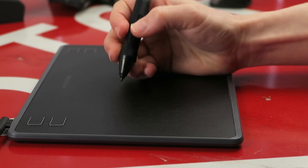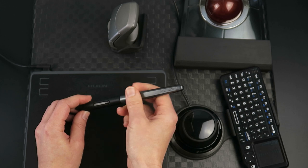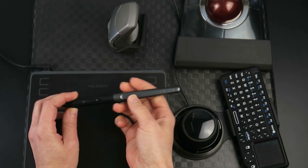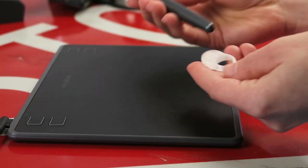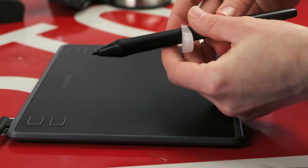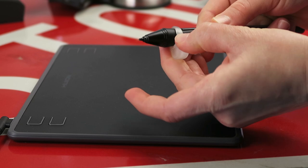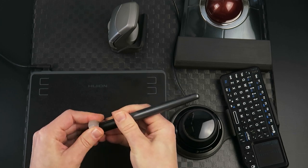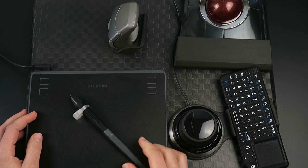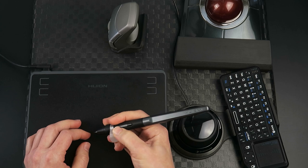The other issue was the buttons on the pen — I couldn't keep track of their position without looking. If your hand is up you can feel the flat portion for orientation, but when your hand is lower and the pen rotates each time you set it down and pick it up, you have to re-find the buttons with your thumb. So I printed a small thumb rest that slides over the top. It can be rotated to whatever comfortable position, and from that point I always know where the button is. When set down it doesn't roll away, and I can immediately feel the correct thumb position when picking it up.